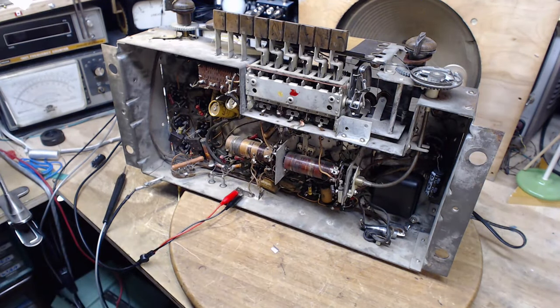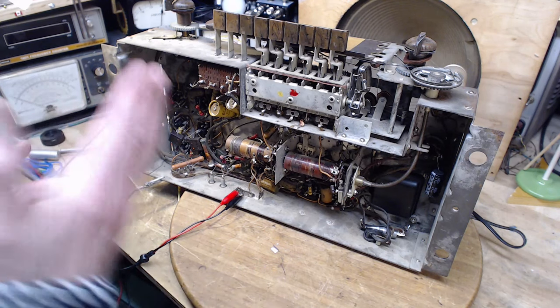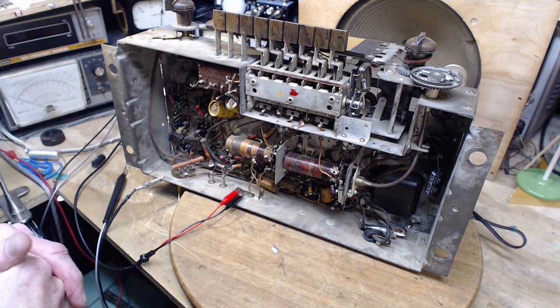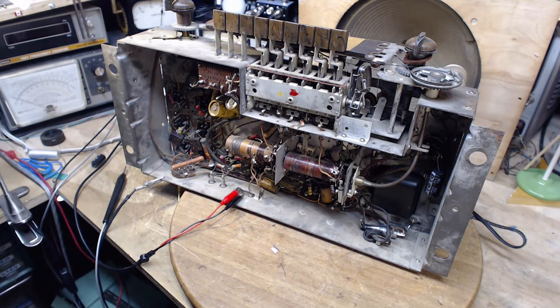Yeah, whew. No smoke evolved, but there's definitely some kind of vaporous stuff coming off that resistor. That is hot. That got hotter than the other one. I would have thought, you know, I know this, I squared R, so I've raised R, I've dropped I, but it's I squared. It's not R squared, Jim. Oh my God. It's I squared. So I raise the resistance, it should drop the current going through here a little bit.